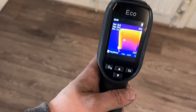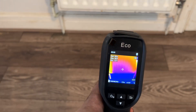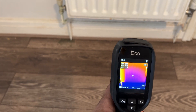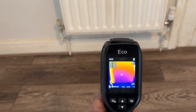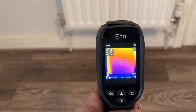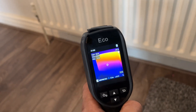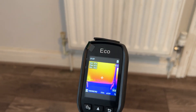We've just turned the heating on now and are using the Eco. You can see we've got our flow on the left-hand side: the heat is rising, going across and falling, and slowly heating up the bottom. I'm hoping that isn't sludge at the bottom. I've already had the heating on a couple of minutes so we'll see how we get on. If we do detect sludge with the thermal imaging camera, I'll suggest to the customer a flush on the system. To conclude from our little test: there is no sludge in the bottom of this radiator — so that's a good thing.